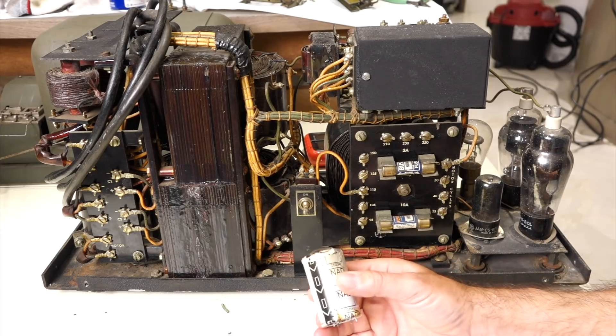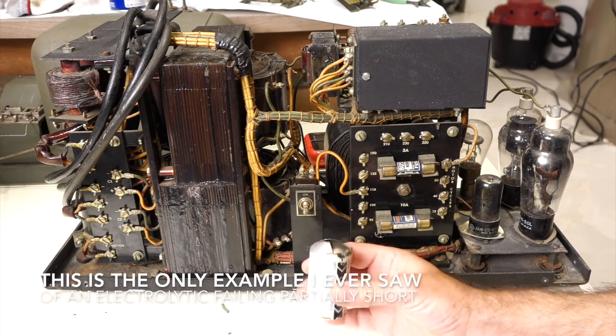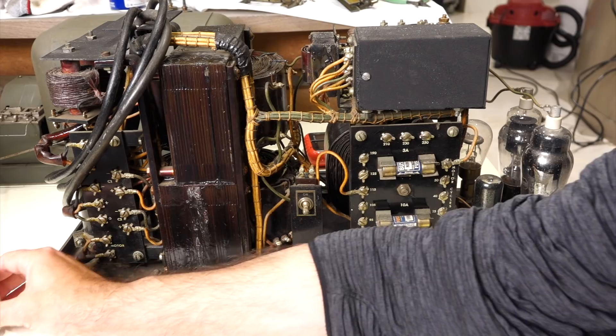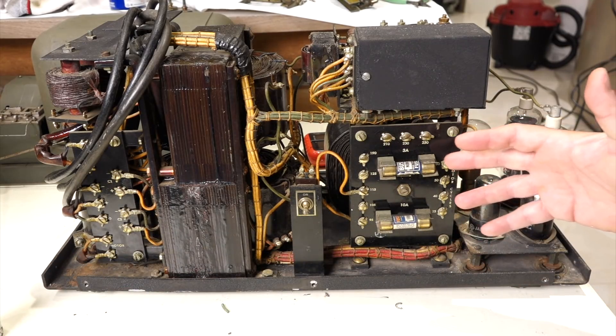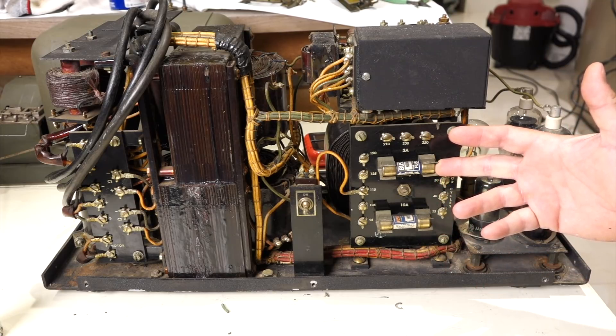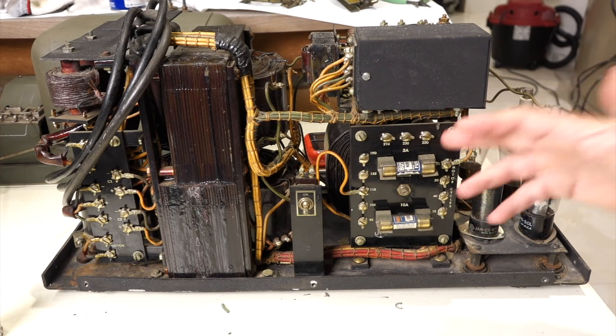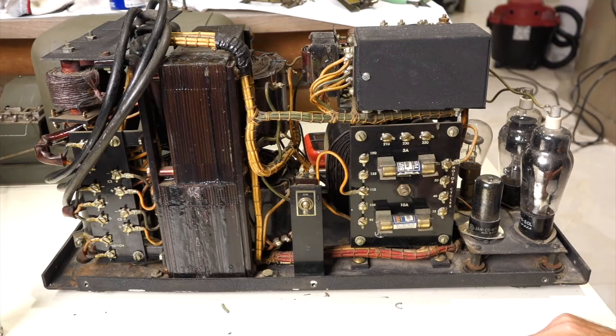However, here's a counter-example of one that failed — not fully short, but partially short. Even so, it was never short enough to trigger the short protection. Because guess what? In the 1930s, they knew you need to protect your power supply from shorts. They had invented the fuse! So this thing is protected by a fuse. In the very unlikely case that a capacitor would fail short, it would very unlikely blow the transformer — but for sure it would blow the fuse. So we are not worried about that case.